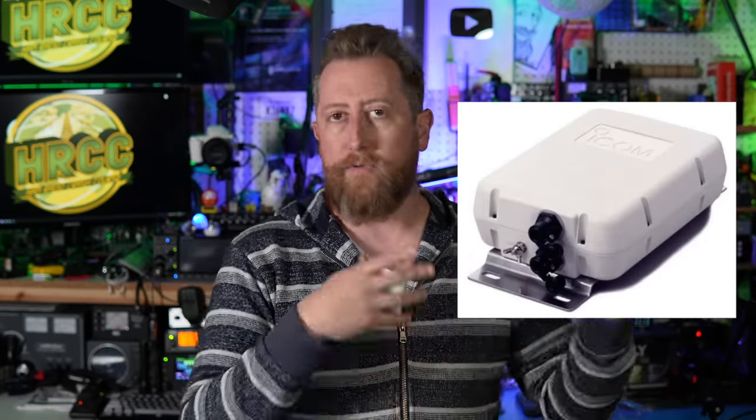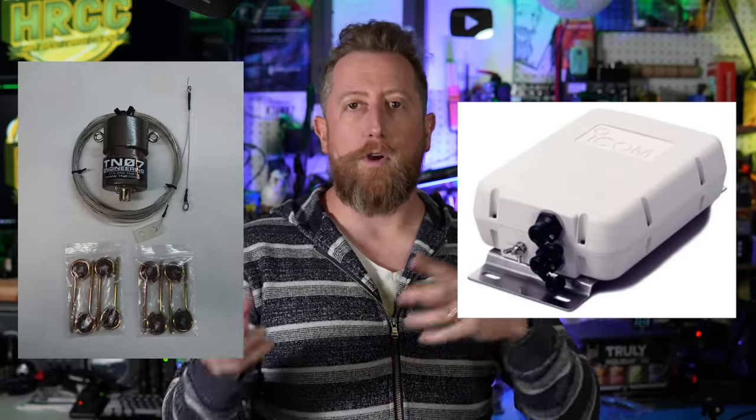Regarding your garage, I'm not opposed to setting up an antenna there either. 45 feet is actually not that bad going from the garage to your shack — 45 feet total is not a problem, particularly at HF frequencies. I'd say up to 100 feet is fine. Just use some direct burial coax and you should be fine. Since you mentioned your garage, I'd also mention that you can do something called an eaves antenna — wire that goes on the backside of the eaves of your garage — and then use an external tuner or a transformer of some kind to make it work with your radio.